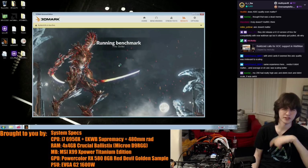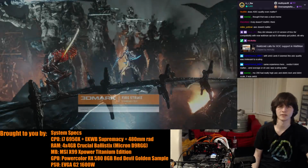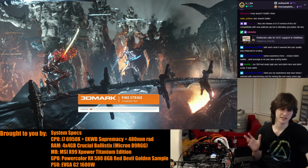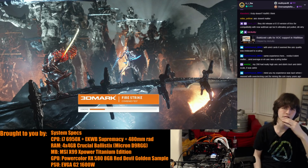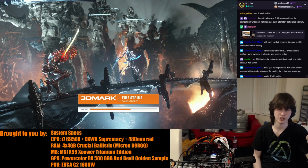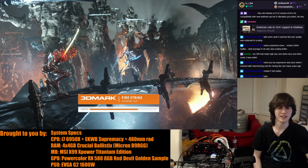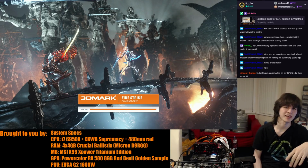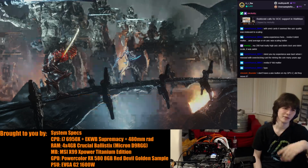And then on NVIDIA's side, it's just higher ASIC is always better. That's as far as I know. On AMD's, you kind of get a trade-off depending on which direction you go. And ultimately, which one's best for liquid nitrogen? Lumi, who's the number one overclocker in Finland, he's binned a truckload of HD 7970s. And he says the best cards for LN2 are like 80% plus ASIC. For 7970s.